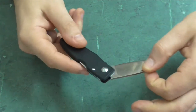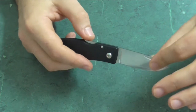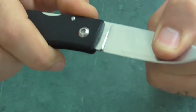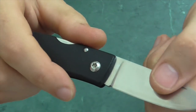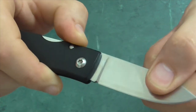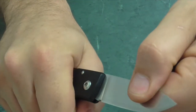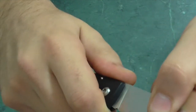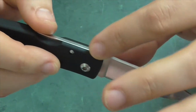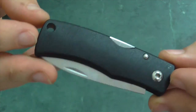It's a lock-back knife — no bells and whistles, no triad lock, nothing like that. The lock-back works well enough and it certainly has decent lock-up. However, one thing that has surfaced over extended use is a clicking. When you cut against something hard and push against it, the knife makes a click sound instead of just pressing a little bit further back against the liner. There's no real movement — it's just the click. I guess it's probably just a case of wear, because I'm always opening and closing the knife, so it's just wearing very slightly and making a bit of a click sound. Certainly nothing too bothersome.